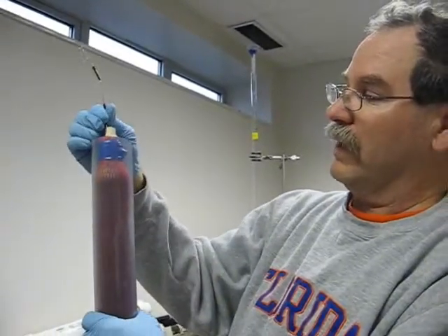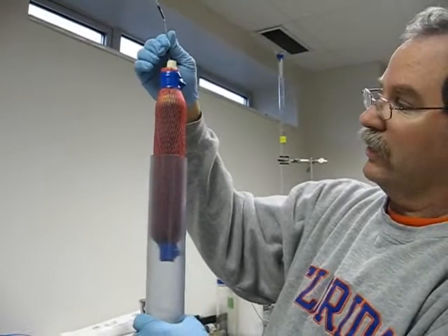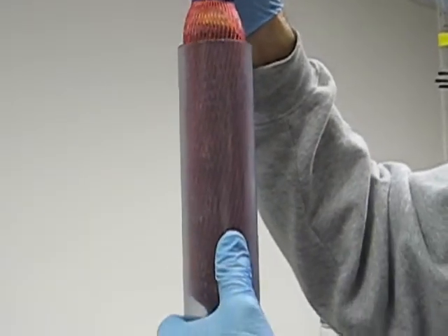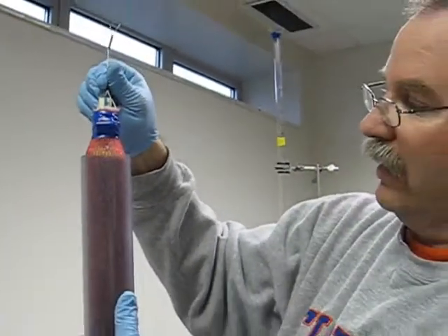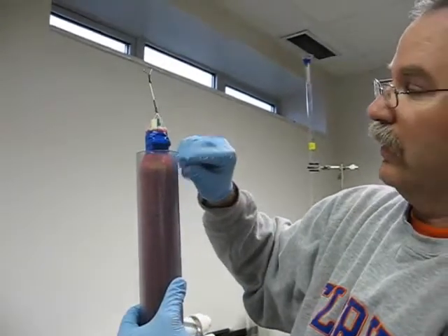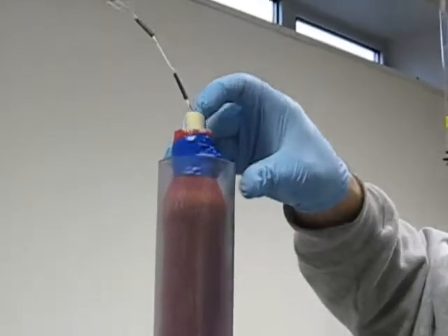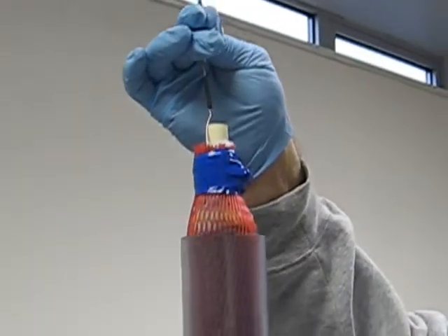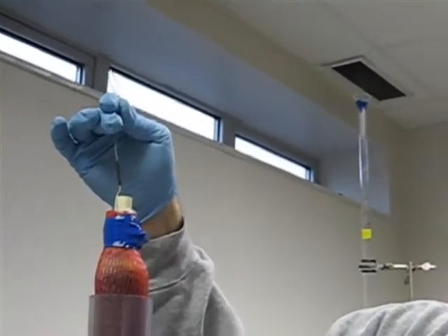The final design of the passive flux meter has the red mesh over the outside. You can see through this clear plastic tube that it's a fairly snug — not tight — fit inside the two-inch well screen, which is a two-inch Schedule 40 PVC. We've got it all clamped down at the top so we can push it in with the center tube and retrieve it with the cable. Now we're ready to go and install in the field.